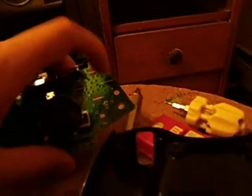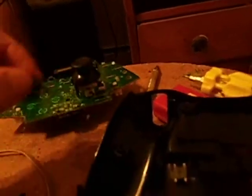Yeah, you just solder the two wires to both here and here, and then here and here, and then run those two wires to these itty bitty prongs on the tack switch. And basically the only thing I use this for is just scratching off that lightly. You don't want to scratch too hard because you could actually take off the copper that's underneath the magnetic coating, and you don't want to do that because then you can't even solder buttons on there. So you just want to scrape it nice and lightly.